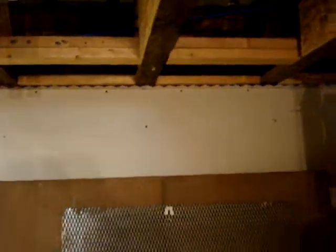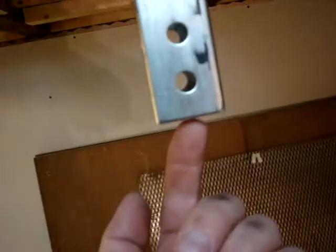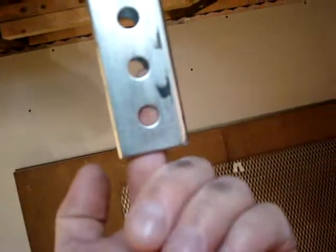What's relevant is the breach. The finished drywall will come at the bottom of this height — see this piece of wood? Drywall will be screwed to this. There will be insulation above this, and then that insulation will have a vapor barrier. So this penetration, where the tool goes into, is now a source of air leakage.